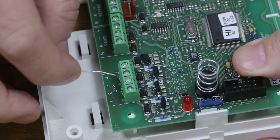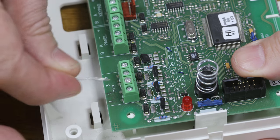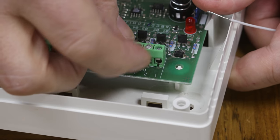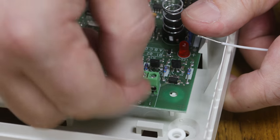One of the problems is often there's an alarm panel side here, so you can't necessarily see where you're poking it. It can be a bit tricky — look, it's done it already. I've now got lots of wire stray, and this is one of the problems: just getting it in the right hole, not having the wire come untwisted and go everywhere. These are good quality screw terminals with a little metal tag on the back, but you have to poke something in to lift the tag up so you can get the wire in. By the end of the day, I was cursing screw terminals.